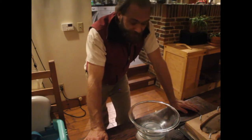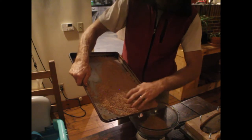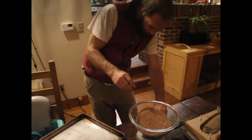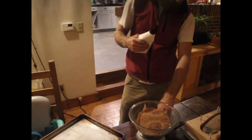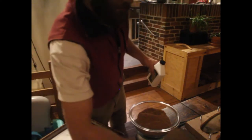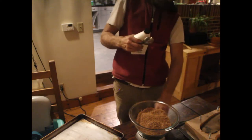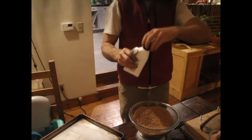So, let's get going. Let's see how many grams I've got here. I'm putting in more grams than I expect I need. I'd rather have it flow out and have extra rather than have voids or too little. Yep, just over 4 ounces, not even 4.1. So 114 grams, and now I'm gonna add 228 grams once I get this added. And here are my bottoms, marked with B. Alright, making the well in the center. 228 grams, here we come.